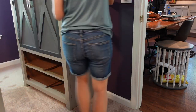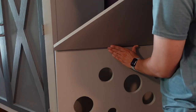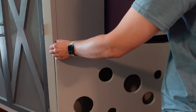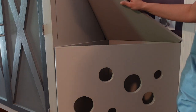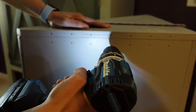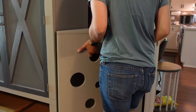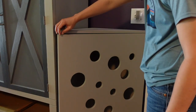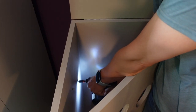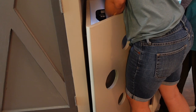I had to spend some time moving the armoire over a little bit to get the unit to fit perfectly in the space. Once it was in place, we tested out different ideas on how to hinge the top, ultimately settling on one side using a continuous hinge. Mom marked the holes and I drilled pilot holes, then screwed it into place. Then we tested it out and decided exactly where the unit needed to be placed, and for safety we secured it with a couple of screws to the armoire next to it. We used two washers as spacers as we needed a little distance between the two units. Nice and secure.